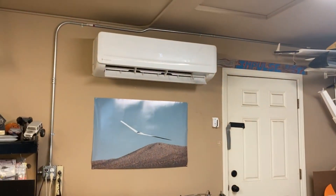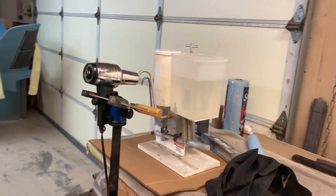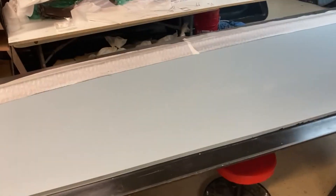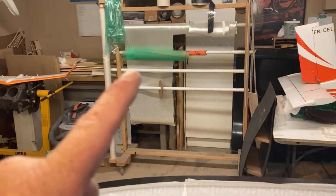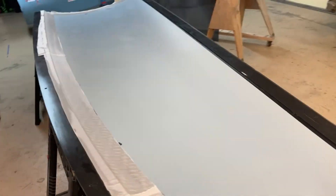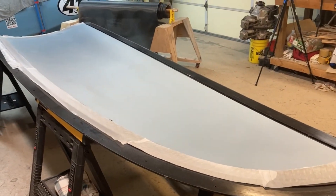It's a little chilly out today, so I've got the heater cranked and I've got my ghetto heater going on the resin pump just to let it wet out a little bit easier. That's because we're going to do a hand layup today — I ordered more flow media and it didn't get here in time, and I just don't want to wait. So we're going to pull it in dry and then wet it out by hand. Progress.